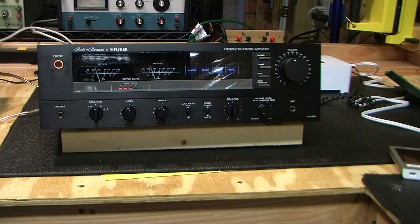Another thing I like to do after running an unknown amp for a while is to smell things — it might sound funny, but when certain electronic components begin to go bad or are bad, they smell like oftentimes burnt popcorn or a burnt rubber smell. They can be very distinct smells. I smell nothing, I see nothing, I hear nothing — that's a good sign.